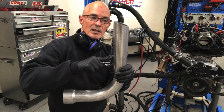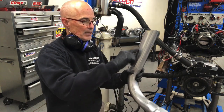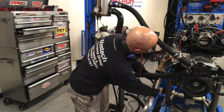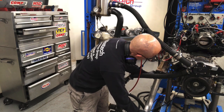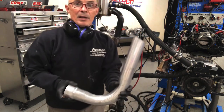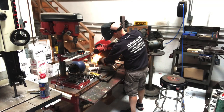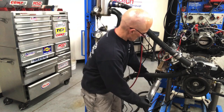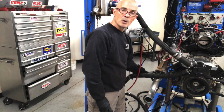Because I knew I was going to be shortening this, I made a practice cut to see if I got the angle right. I hold this up and see if the angle is right, then all I have to do is bring that angle down here because I want to get rid of a bunch of this length - that makes the turbo too low. So we check how our cut did - it looks like our angle should work pretty well. Now all I've got to do is cut that same angle just down here and we're in business. So we've got our pipe with our angle cut - this is ready for the v-band. We'll mock it up - seems fairly even with the other side, so we'll go ahead and tack weld it up and give it a shot.